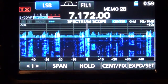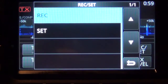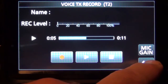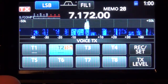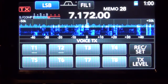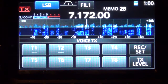So I have inserted the SD card back into the 7300. I'm going to hit Menu, then Voice for the voice keyer. I'm going to hit Record, even though we're not actually going to record — you can play back what's there. There's that file. If I go back and hit T2 — oops, I didn't realize I just QRM'd those guys. But as you can see, there is a quick hack and workaround to retransmit audio that was recorded off the 7300, as long as you name it the same files that the voice keyer uses.